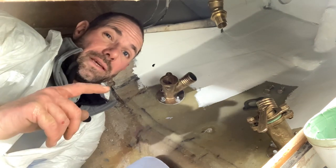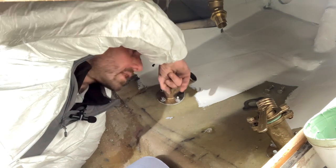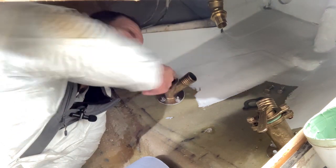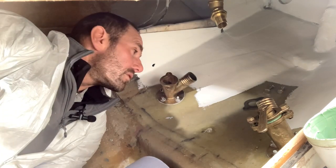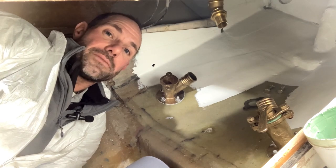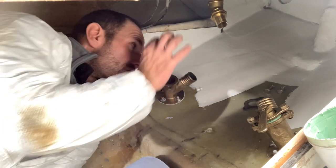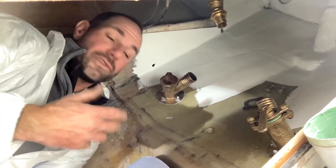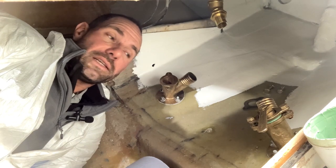One of the things you need to be careful of is that inside the valve body there are two little machined slots, and they're designed to hold grease once it's been repacked, but they can also hold that valve grinding paste — so you need to make sure you get that really, really clean. Sometimes you just want to get a really small flat blade screwdriver and just run it down that slot with a piece of tissue on the end of it, just to make sure it is fully cleaned up.